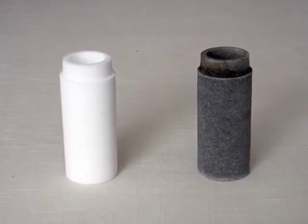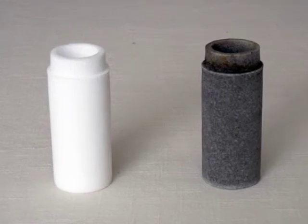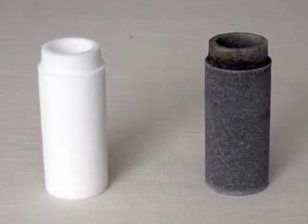This is because the filter is trapping the particles of the power lead which are eroding away. The annual preventative maintenance kit includes two filters and enough coolant for two services. Hypertherm recommends new torch leads every two years.